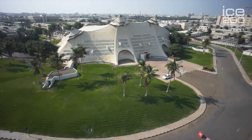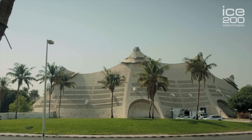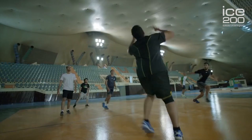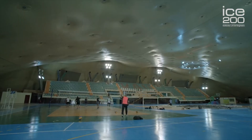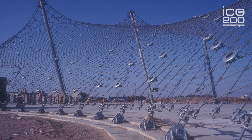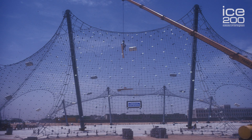This is a sports hall with a 2,000-seater stadium and all the associated facilities, which is a large tension structure — different from your conventional compression structure. Based on a traditional Bedouin tent from the region, the roof is a massive cable net in tension strung between eight masts.